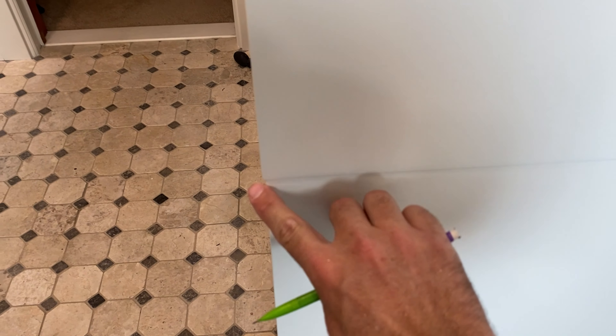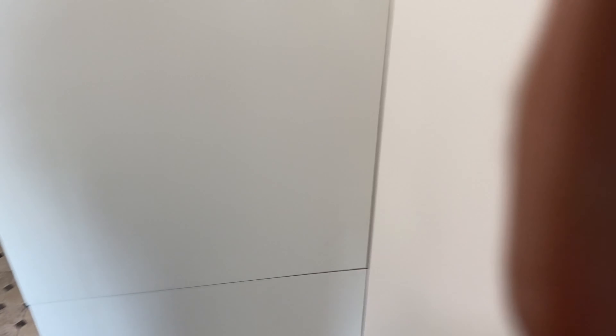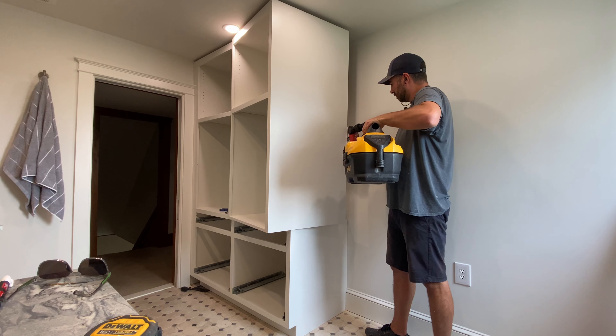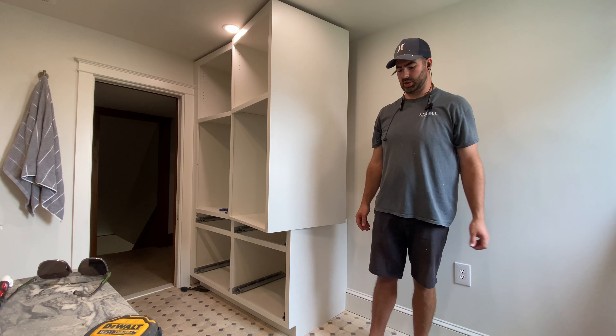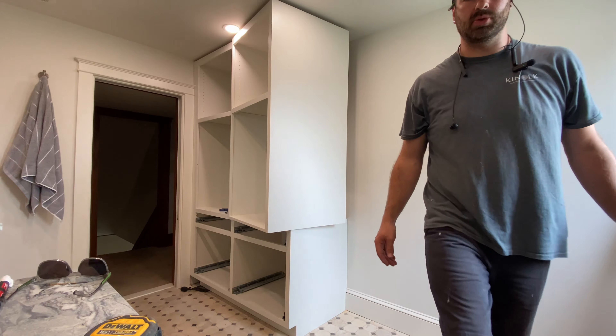As you can see, I'm hanging over just a little bit there and you can see that my wall has a slight bow in it. I'm just going to take my power planer and take a little skosh off the middle there, and that'll allow this whole cabinet to just shift back just a hair to line those two faces up and get that tight to the wall. Worked pretty good actually — kind of a ghetto setup and a little annoying to use, but better than spewing dust everywhere.